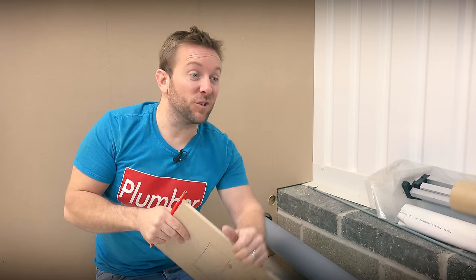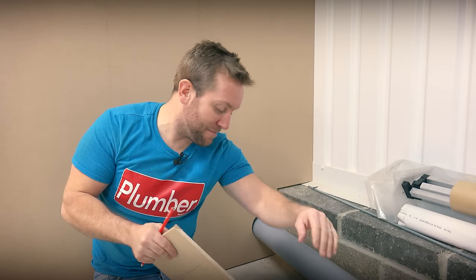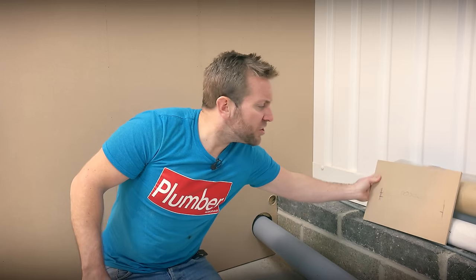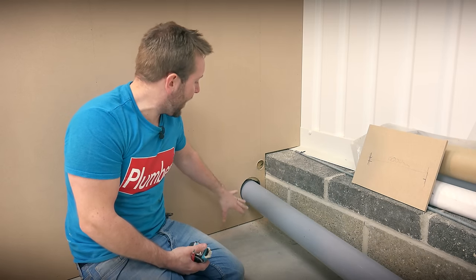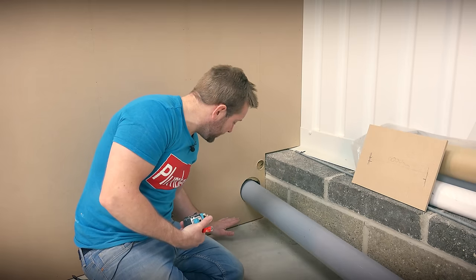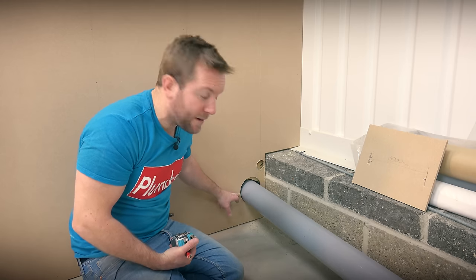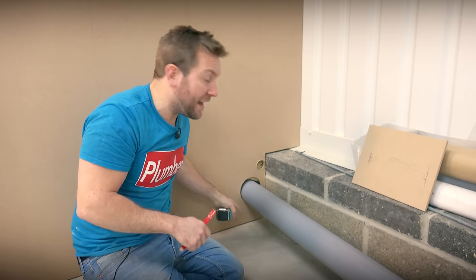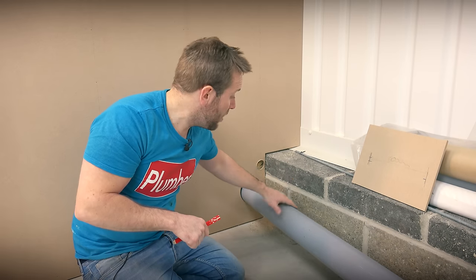Things like that if you're interested, follow us over on Instagram - I'll leave a link appearing right now for you to click on, and also there's a link below. Let's go over and actually have a look at where we're doing this. Why have I drilled a hole here? Well, it's quite simple. I know that my toilet is going to be sat on this floor here, so I knew exactly where the height of my toilet outlet was just by measuring up from where it sat on the floor to halfway up the toilet outlet. Then I knew exactly where the centre was to drill my hole.